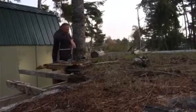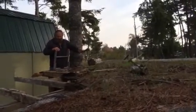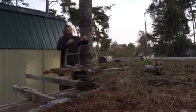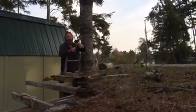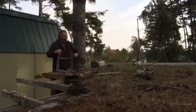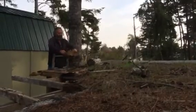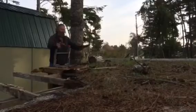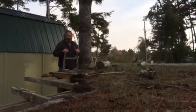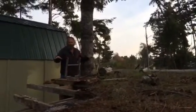So we're going to have to tear all this off. We've got this rolled roofing up here nailed down, and underneath that is this tar paper. It's white because there's actually microbial growth, kind of a fungal thing going on with all the moisture trapped underneath all these layers. And then here's the actual OSB, and you can see that it's just rotting away, and there's lots of little critters crawling on it, chewing on it and having a good time. We're going to be interrupting their feast and fixing this up.